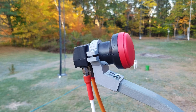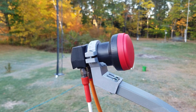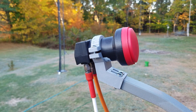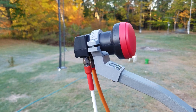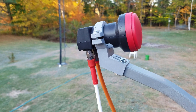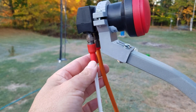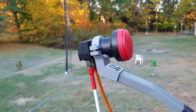You want to use the vertical probe because on every LNB I've tested, and from test results from others, the vertical probe produces a lower noise figure, which means better performance for weak signal reception — which EME certainly is. When you feed the proper voltage around 12 volts to select vertical polarization, that means it's vertical when the connectors coming out of the LNB are pointed downward toward the ground. That's vertical polarization.